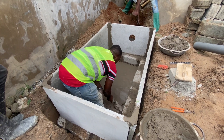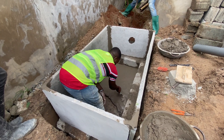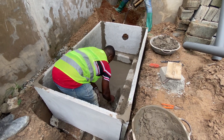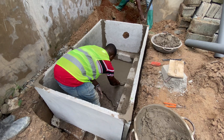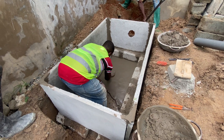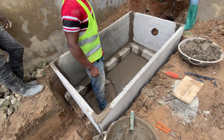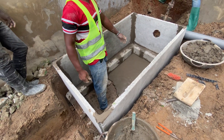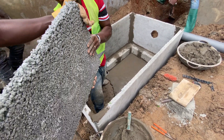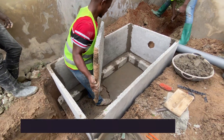Sometimes you include charcoal in it depending on what the water is going to be used for. The porous slab is bigger than the size sometimes — when you are casting them they spread out and become bigger — so it's being cut to the size of the digester before laying them in the digester bed nicely. Make sure you don't break them, because if they do break it's going to have an effect on the digester bed when the load starts coming on it.